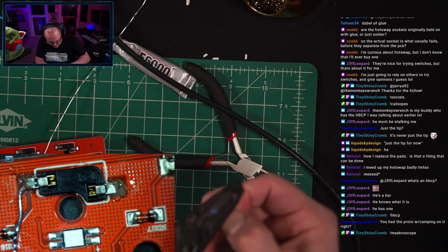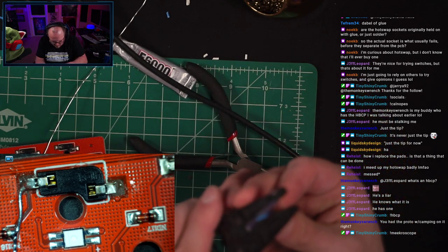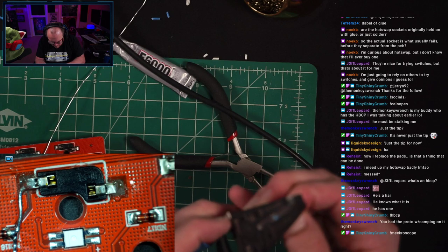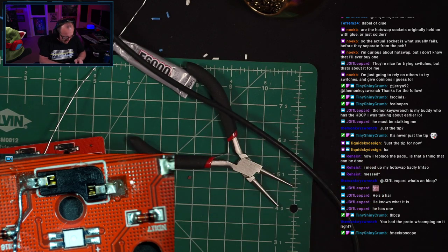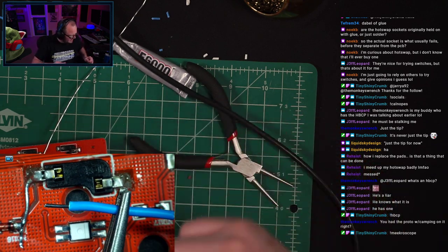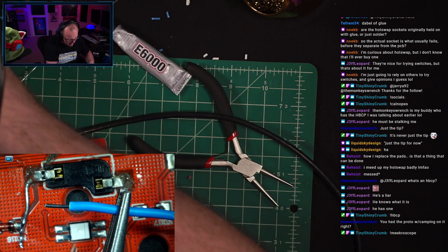I guess you guys didn't see that, but you will. Okay, so now what we're gonna do is, right, we're gonna take this little wiry deal, we're gonna curve it. This is gonna get real interesting. So we're gonna tin that side, but not the other first. I'll show you why. We're gonna tin it before we solder it, but we're not gonna tin it until after we've soldered this side on.